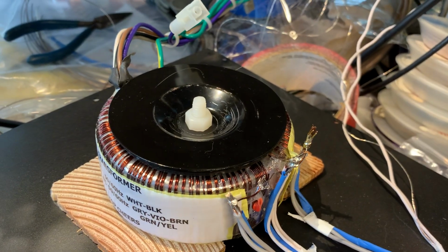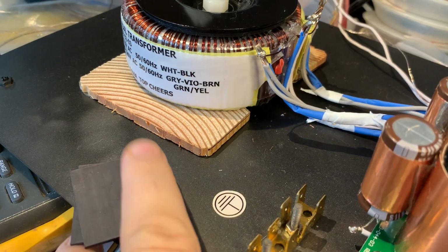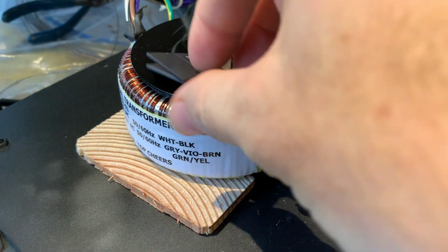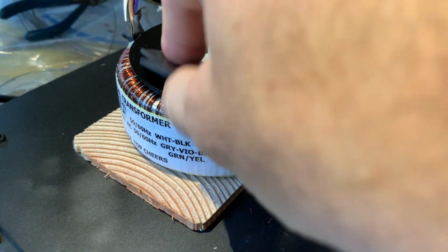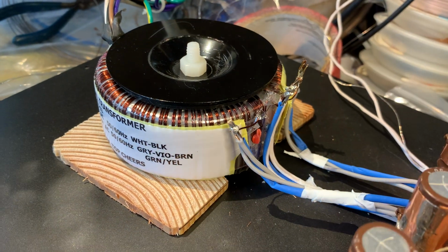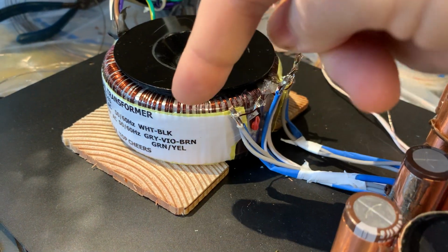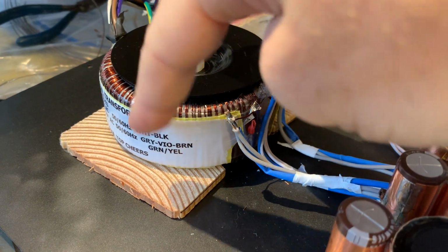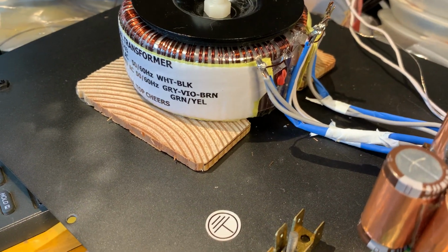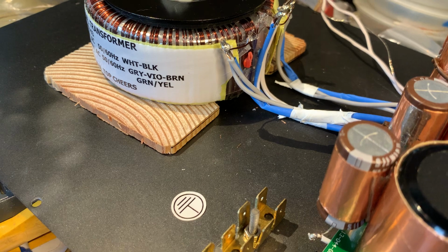It's so important because when you look at these things, this chassis is magnetic. So if I put a magnet here, it sticks there, right? And this thing is also magnetic, so this sticks to that as well. So what's happening here? The magnetic field that's generated by your transformer, if you have this metal screw here, metal piece here, metal piece there, that magnetic field is going to get coupled through all of these elements onto your chassis. So you are going to spew a bunch of noise directly into your ground plane.